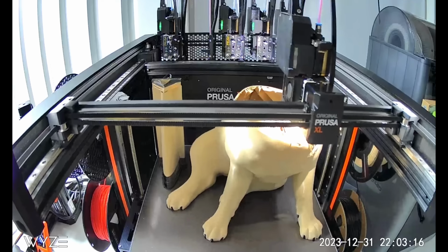Of course, I didn't even get as far as the last one. The last one I got farther. And of course, it has the same kind of issue halfway through or so where the collar started. So there's just several defects in the tower that's causing issues in the print. When I had talked to Prusa about the issues that I was having with this originally, I did ask about not having a purge tower, and they said that it was not recommended. So that's partly why I ran it the second time at higher temperatures, and kind of tried to change up the infill. But I feel like the tower is the problem.